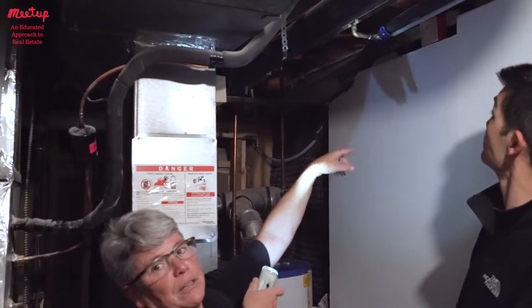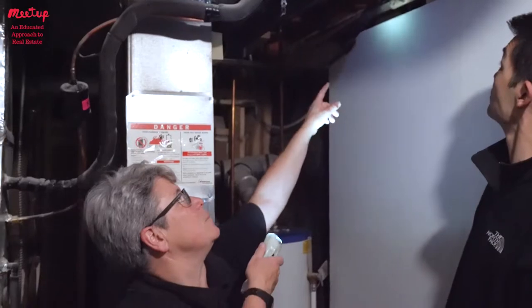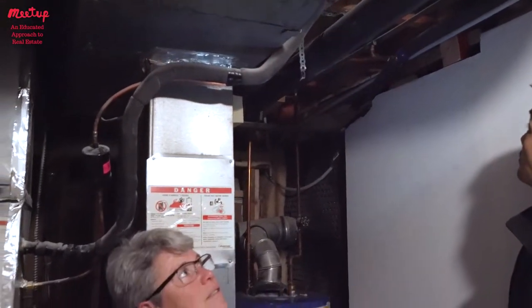Up here is a new water shutoff valve for an outside hose — that's something you need to shut off in the winter and drain on the outside. That's very important. When you see a brand new valve like that, it's a good sign. Sometimes you'll see houses that have had very superficial renovations, and then you look and all the plumbing is really old.